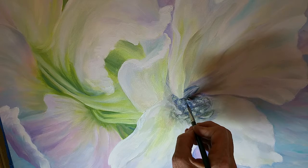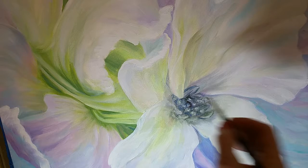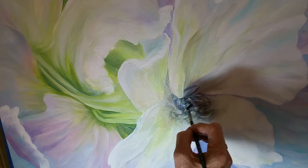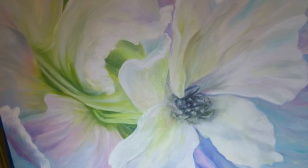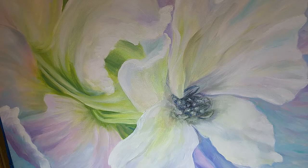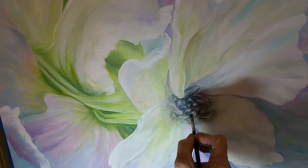I just wanted you all to see that just the solvent itself is going to make it darker. But you could have just come in and painted this dark. I want a stiffer brush so I can spread that solvent. The solvent allows the paint to spread easier and thinner — it makes it more transparent. That's what a glaze is: a glaze is transparent. A glaze will never, or should never, totally cover up what you've got going underneath. It's just going to enhance it.